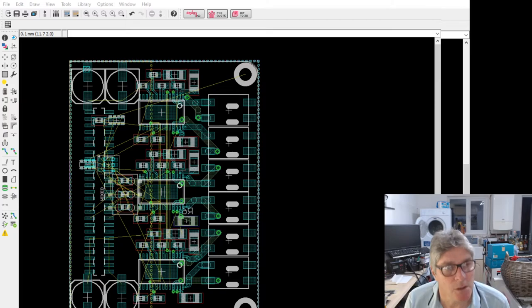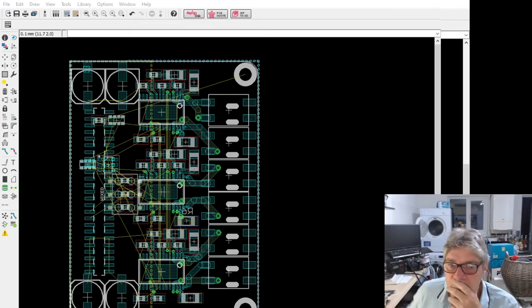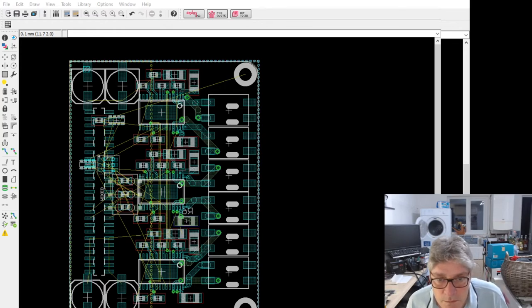I could use a wired OR, which is three diodes. Possibly. Have to have a think about that. That would leave the interrupt free, because I'm not sure I want to use the interrupt for the end stops. So I'll put a question mark on my schematic actually. Wired OR to TR. I'm just leaving a note on the schematic so I don't forget that.